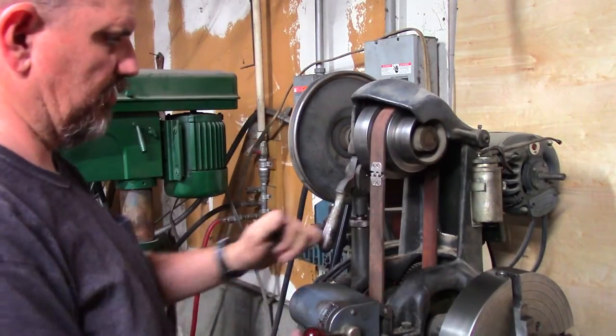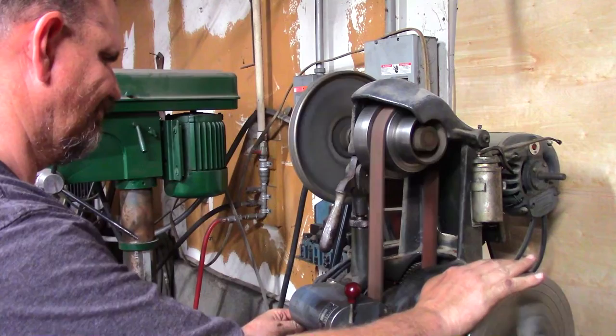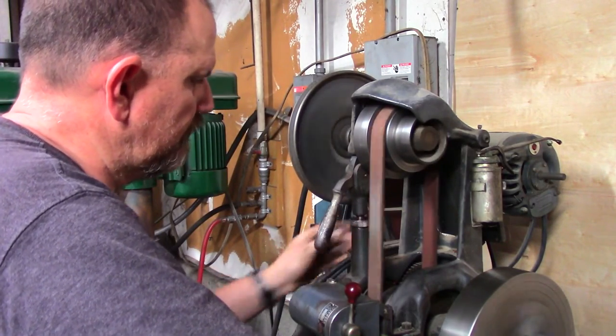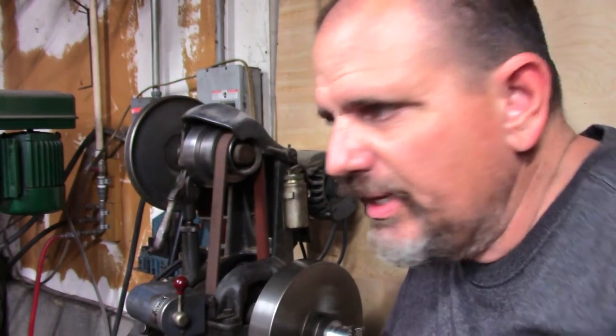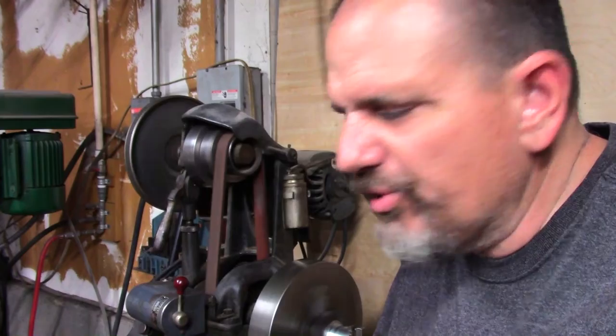There you go. Now let's... Right. I was having some trouble with this. It didn't want to track. It kept popping off, that kind of stuff. Cleaned the oils off of the surface of the belt on the skin side. I cleaned all the pulleys. And I've been just letting it run for a while, and it seems to be getting better. So that seems to be the best. That seems to be working.